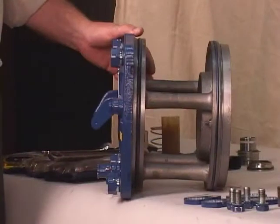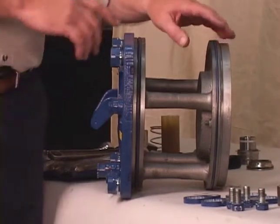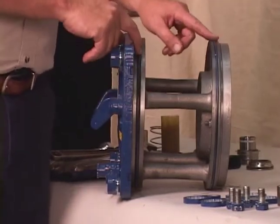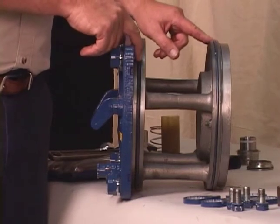Replace the back cover O-rings and lubricate them with a generous amount of number two grease. Clean any scale or debris from the contacting surfaces in the pump casing that might interfere or prevent a good seal with the back cover.